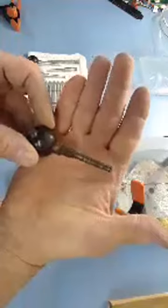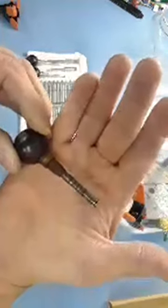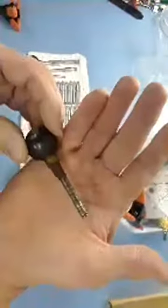I'll give you an example. I started yesterday with an old joystick from a Mario Brothers — Mario Brothers DK3 VS Unisystem. I took it over to the wire brush, cleaned it up, removed a little part, and hung it in a bath of one quart of vinegar and 100 grams of Epsom salts, mixed together. Then I used some zinc anodes and a small battery charger.